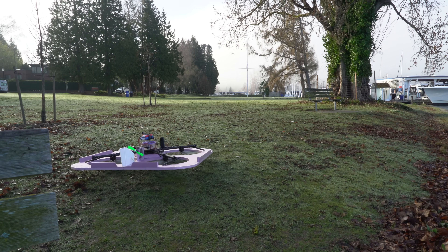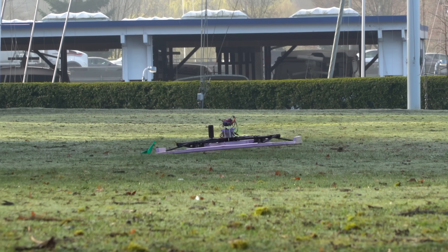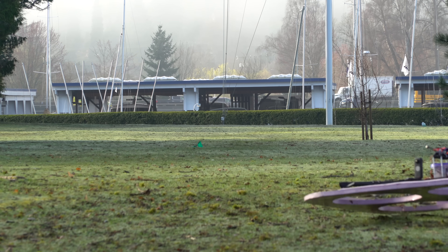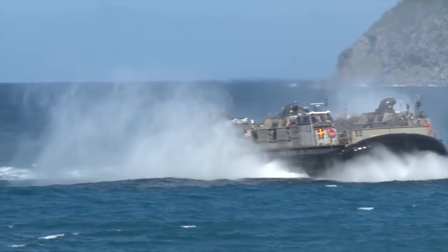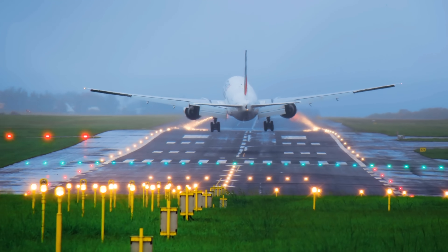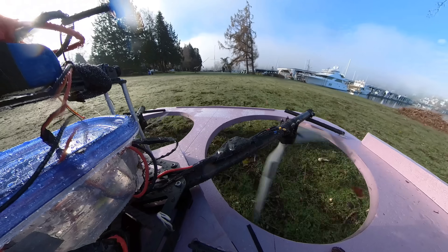So, back to the main idea here — are ground effect multirotors going to be the next big thing for transportation? Nope, definitely not. Sure, they're more efficient at hovering low to the ground, but what's the point of hovering low to the ground? For any practical transportation application, you want to go fast, and for that you want a fixed wing ground effect aircraft instead of a rotary wing one. Traditional hovercrafts have their place and are probably even more efficient than ground effect multirotors, since the skirt really optimizes the air cushion — and yet they still aren't very prevalent today. A normal airplane or helicopter is pretty tough to beat. This has been a fun concept to play around with though, and it was cool to see just how much more efficient a propeller can get when it's up against a surface. That's all for this video — thanks for watching.